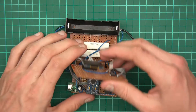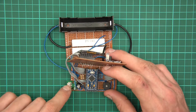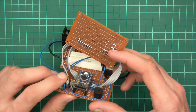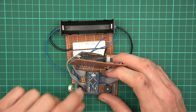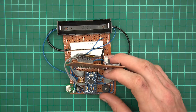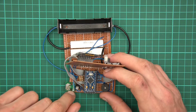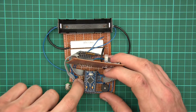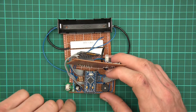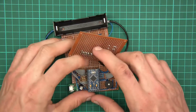Over here I've got the micro USB connector and a capacitor — a 330 microfarad 6.3-volt capacitor. I added that because it seems to stabilize the internal voltage reading; it makes sense since you don't want fluctuations. Then I've got three resistors — around 5k if I remember right.